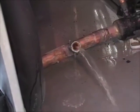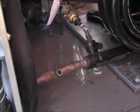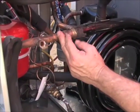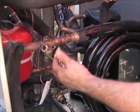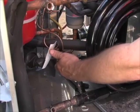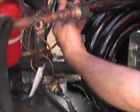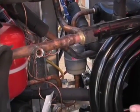That's going to allow us to further bleed down any fluid still captive in the coaxial heat exchanger. Now we're getting close to being ready to cut not only the refrigerant lines but also the water lines going in and out of our coax. We're going to try to cut them to where it's going to be an easy area to work on and make our connections. We're going to make sure to wrap our thermal expansion valve with a good wet rag — sometimes people use thermal paste, which is even better — to protect it from heat. We will probably go ahead and attempt to unbraze the refrigerant connections and cut the water lines on the coax.